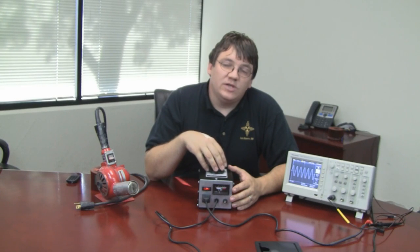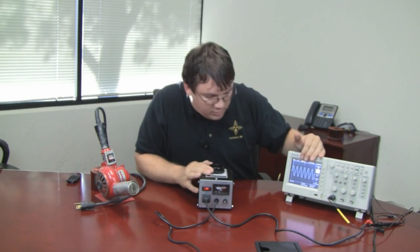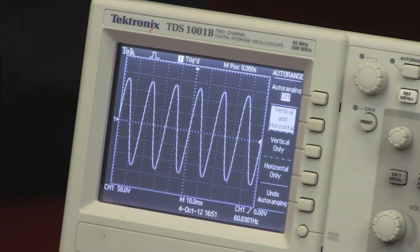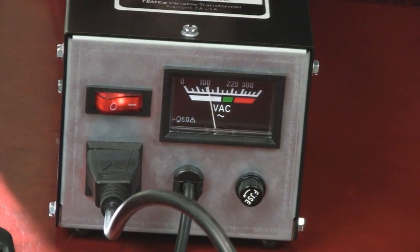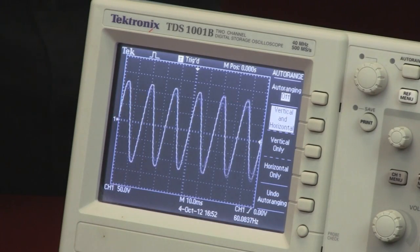Use one of these when you either want to set voltage or adjust voltage on the fly. Here on the scope is the output waveform from our variac. As I turn the knob up and down, you can see the voltage transitions very smoothly anywhere from zero volts all the way up into the 140-volt range. There's no flicker or anything like that — it's not changing taps. It's a very smooth sweep across those sanded copper portions I was showing you earlier.